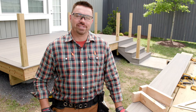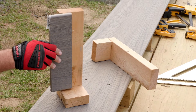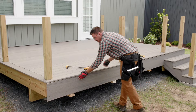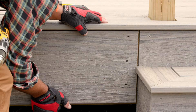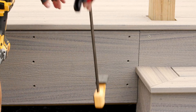The fascia is cut to length and pre-drilled, so I'm almost ready to attach it to the frame. Because I'm working alone, I made a temporary support from wood scraps to support each end while I adjust the fascia into position. I clamped the fascia temporarily so that I could make my adjustments, checking both ends and making sure I leave a slight gap for shrinkage of the wood frame as well as movement of the fascia.